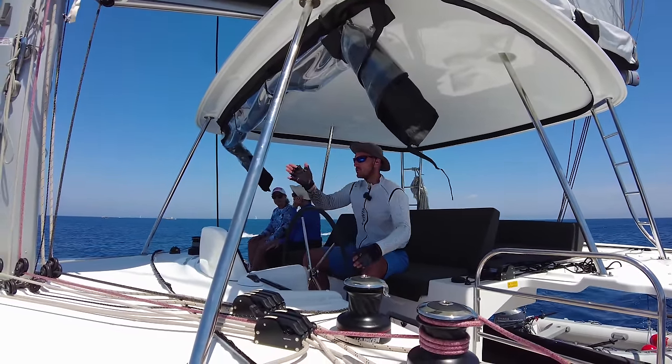Now Holger is going to clean up this spaghetti mess. Sometimes we just put everything in, but when you have to put the sail down, you have to release this rope, because this is the rope that pulls the sail up, and it has to go down. If you put it nicely in this way, it's going to be very easy to release the sail in a panic. If you just put it in like all the spaghetti, something's going to get stuck. So this is a good practice. Although many times we're too lazy to do it, you should do it.